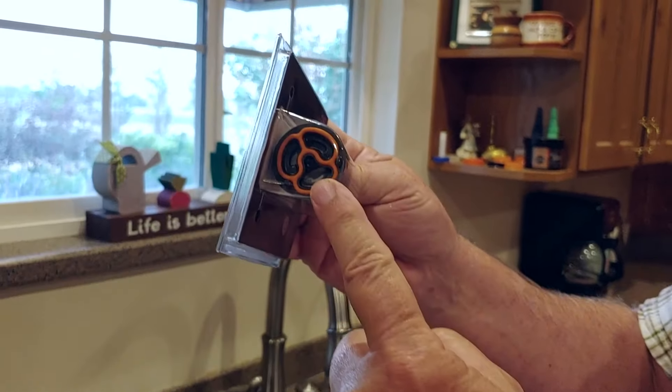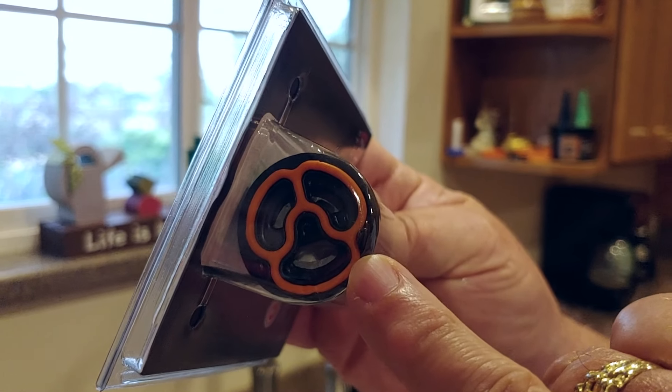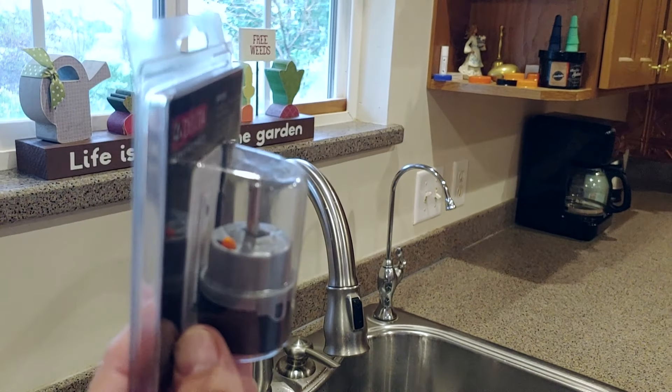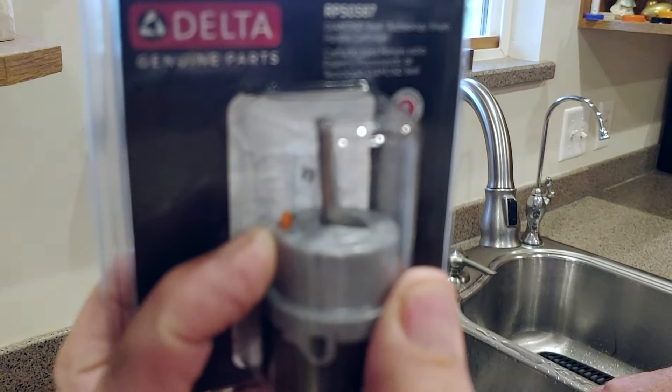So you've got inlets and an outlet all happening right there. Plus, there's an integrated seal across the bottom that is already in place, ready to go. On the top, here's your control handle, and inside there you'll see this little orange slider. That is your temperature limiter — it controls how much hot water is allowed in from the hot water side, greatly reducing the likelihood of scalding from a water heater that's set really hot. So if you've got uncomfortably hot water coming out of this, you can adjust that right there. There are instructions on it.